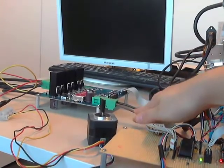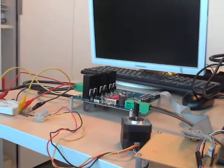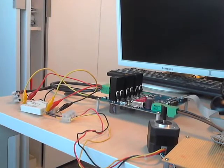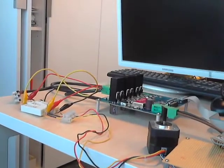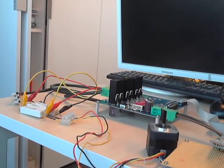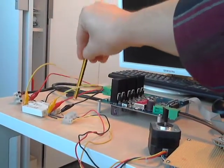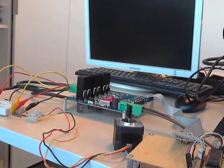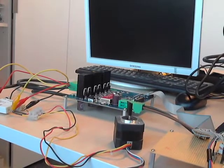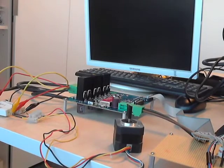Okay, this is the power cord of the motor driver. The motor driver is going to make a 3-phase signal which goes to the motor. It has some resistors, so it can limit current, but now they are shorted with these crocodile cables. To limit some current, but not quite needed. Okay, and the motor is going to move because it's going to get those signals.